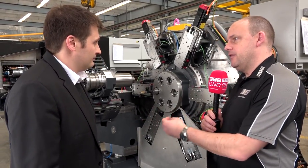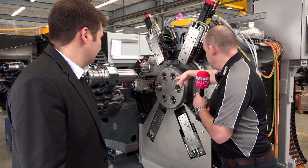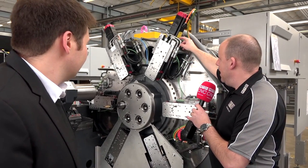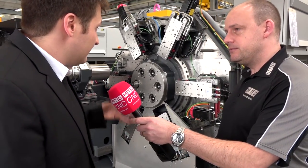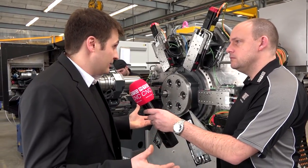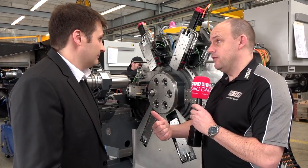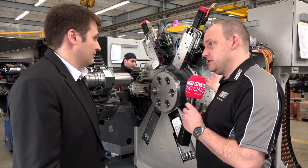So that coupled with the hydrostatic system will give you a lot better quality of part. These are your six spindles — we can see this going together, this is the area where the tools are attached. All of this is integrated, and we've got pipe in here because you have high-pressure oil going through. It's all integrated into the slide so you don't have loose tubes in the machining area, minimizing the risk of chips getting stuck. Chip removal is key on this type of machine since you're really producing swarf, and this design also helps reduce tool wear.